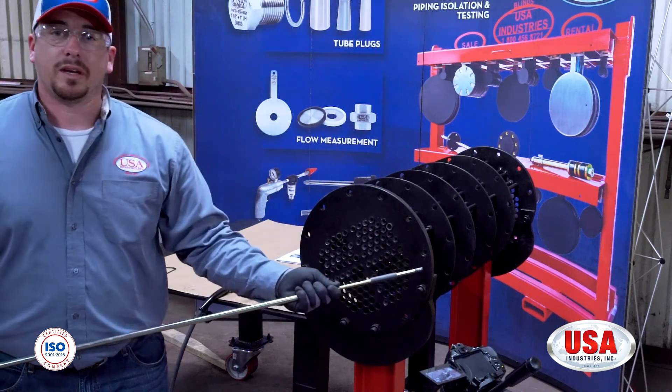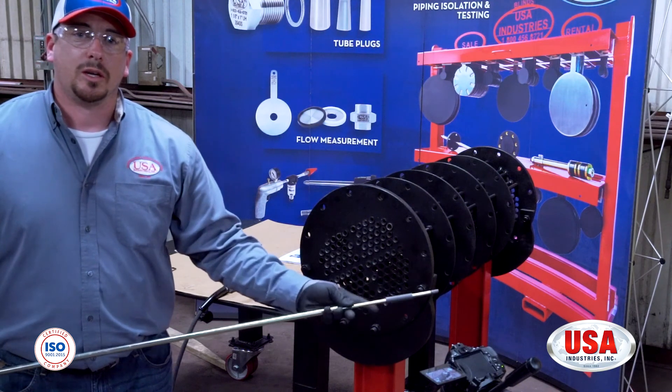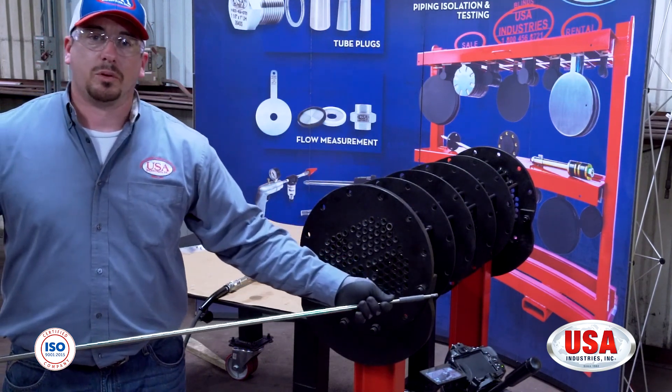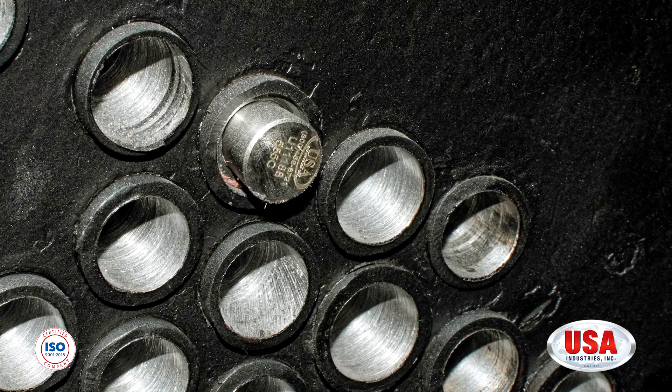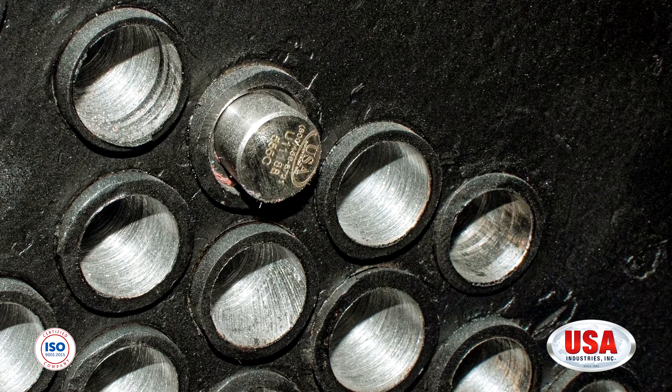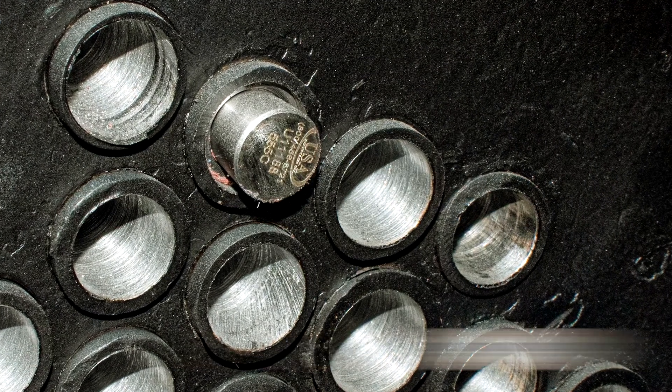As you can see, we were able to get everything out of the ID of the tubes. You have your plug positioner, you have your coupling, and your full Channel-Head Pull Rod Assembly. Now we have successfully installed a Snap-It Junior 555 carbon steel Snap-It plug on the far end using Far-In through-the-tube plugging.